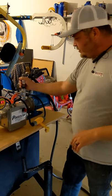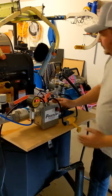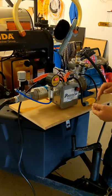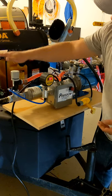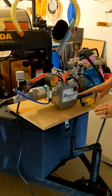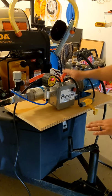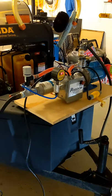As we go through, we've got the motor, the check valve, the diffuser, the diffuser tube right here, and then we've got a little T on the output and the input. I've got to give a shout out to our guy Bill Mabee — he's over at the Pressure Washers channel and he turned us on to this T-Jet unloader valve. The way this thing works is if the pressure ever gets high enough, it will actually start diverting fluid back through into the intake.